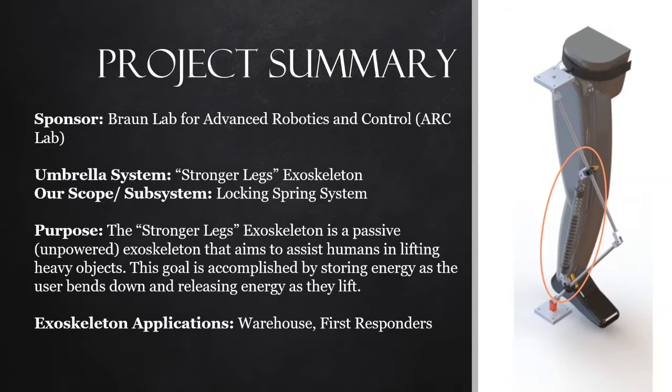Our project sponsor is the Vanderbilt Braun Lab for Advanced Robotic and Control, also known as the ARC Lab. The system that we are working on is the Stronger Legs exoskeleton, which has the purpose of helping humans lift. This is conceptually accomplished by storing energy in a locking spring system as they bend down, and waiting until the human decides to lift to release that energy.